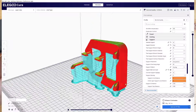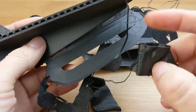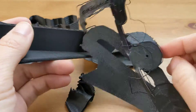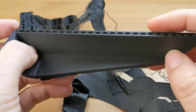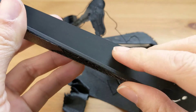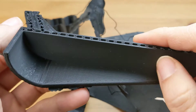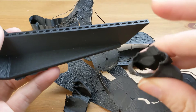If you can see the slicer demo here, what happened is that the tree got flipped out of the base — you can see the base here, it got flipped out so it doesn't stay anymore. Of course with it flipped out, it won't support the features when it gets higher. I had to stop the print in the middle, even though the quality was super good — I printed at 0.16mm per layer, it was awesome.